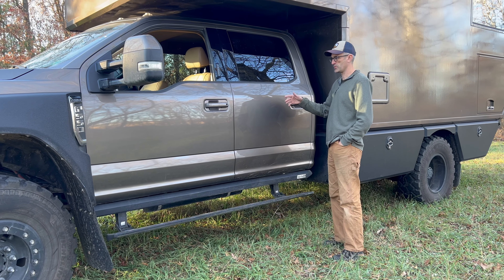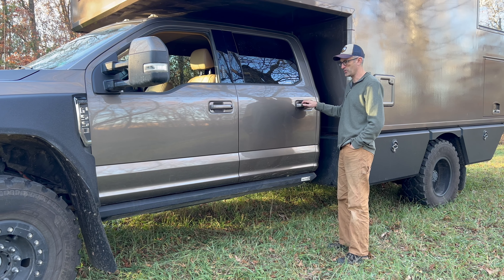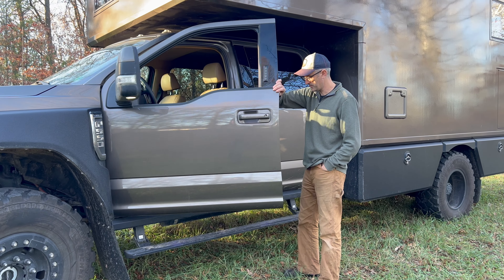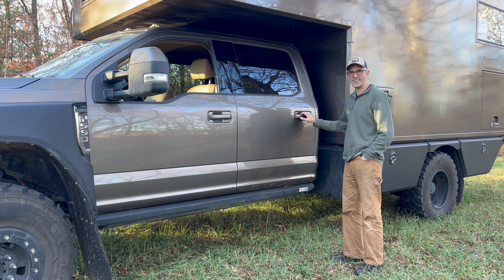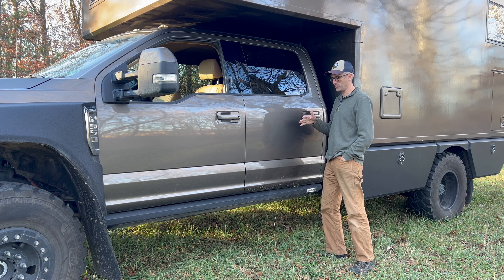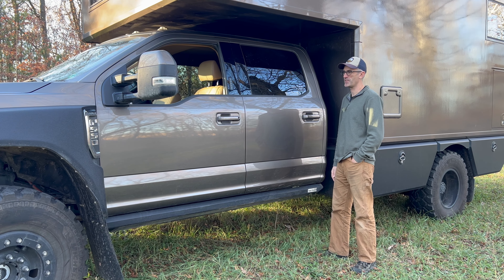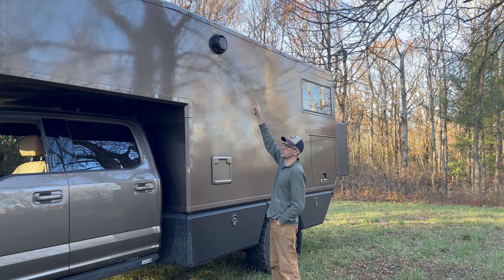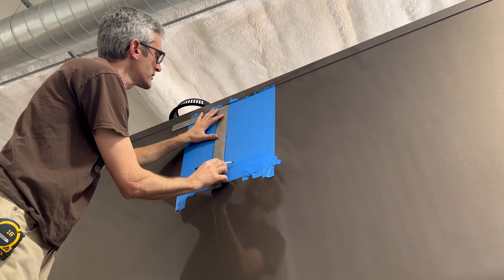This is all eighth-inch aluminum and has the same geometry as the storage boxes for the ceiling. There's a piano hinge up along the top and then gas springs for lifting it up. I found a really cool website for designing the layout of these. I've done it manually before and it's kind of a pain because you have to worry about so many geometric factors — you need to have the vectors just right. I wanted to make them strong enough so that if we were getting bikes out and it was windy, I didn't want this getting blown down and hitting somebody in the head.